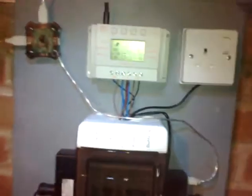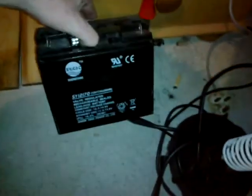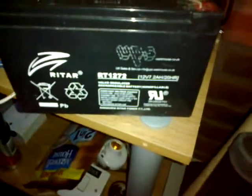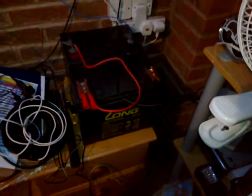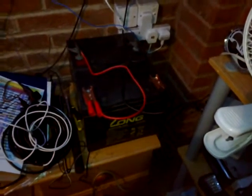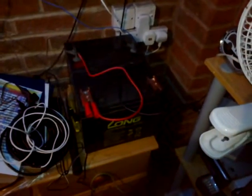That's quite a high-powered light compared to those ones. The only problem I've got now is my panel's not going to be enough to keep these going. I was running off that 20-amp sealed battery, and then the 7-amp that's going back in my little go-box. I've got a 10-watt panel that kicks out just under an amp — 21-volt open circuit — and I don't think my little solar panel is going to scratch one of these batteries. Putting them both together, 150 amp-hours on a 10-watt panel, is absolutely pointless. That's going to take months to charge.